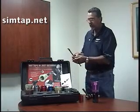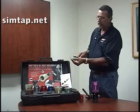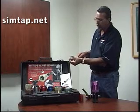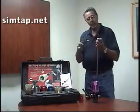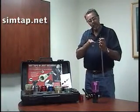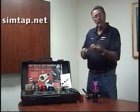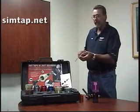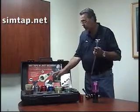The SimTap Drilling Machine has a carbide tip pilot bit with a coupon retaining wire. Simply take the flat surface of the pilot bit, slide it directly beneath the set screw, take your wrench and firmly tighten down the set screw into that flat surface. That will prevent the pilot bit from spinning freely, and the lip on the back of it will prevent it from pulling out, so it's really seated in there pretty good.